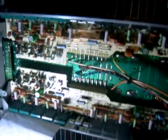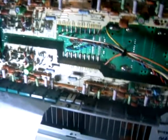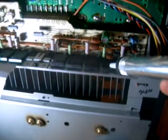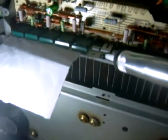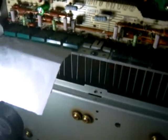Now it's actually not a big deal to take out these amplifier boards. Yes, it looks scary, but really if you can take out a screw you can almost get this done. Where every transistor is, you're going to find there's a screw holding it in. So you take out the ten screws along these ten transistors, and you take this screw out too. I left this one in there because that's just holding it in so it doesn't move until I finish taking it out.